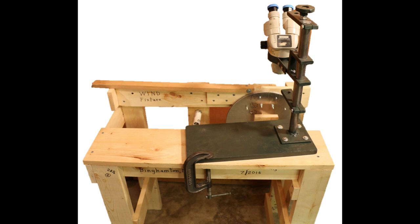Overall, this is just a wooden structure to hold the metal mandrel that we'll wind the wire on. The wire comes from a spool down to the left. You can see the end of the spool. It comes up through a white wire tensioning device, so it maintains a certain amount of tension on the wire as you're winding it around. The operator would sit along the side, and because the wire is so small, you have a microscope that you can actually see where the wire is going as you turn the mandrel by hand and watch the wire go on.